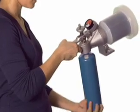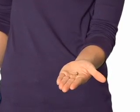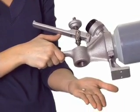Finally, remove the propane cylinder from the ProSolve unit. Once removed, turn the cylinder upside down and the valve stem will drop out. Then disengage the nylon sealing sleeve by lifting the upper handle.